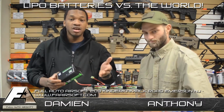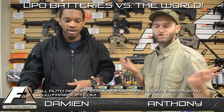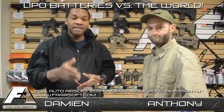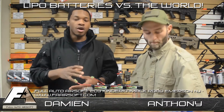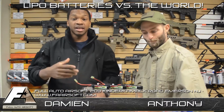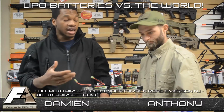So whether you have a half charge, let's say you went to the field, you only played half the day, you went home early, maybe you didn't shoot much, so you only have half a charge in the battery. That smart charger is going to put the other half back on the battery itself. It's not going to be like a trickle charge where it's going to keep sending juice, and that's how you kill a lot of nickel metal hydrides.